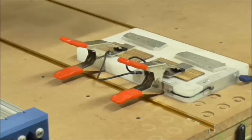Okay, step two. We're going to do the backside countersinks as well as the cutout for the plunger spring housing. If I was going to be machining a set of grips that had an ambidextrous safety cutout, this is where I'd be doing that as well, but as that's not on the original print, we're going to leave that step off of these grips.